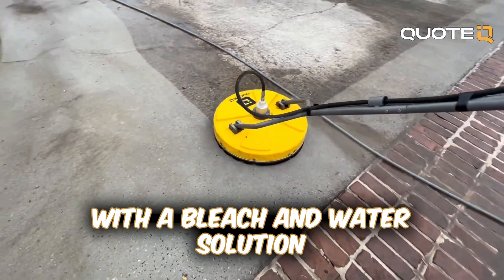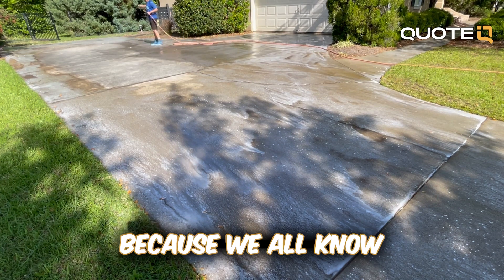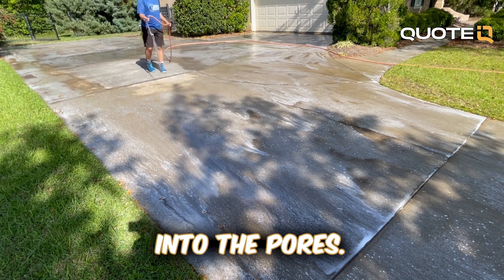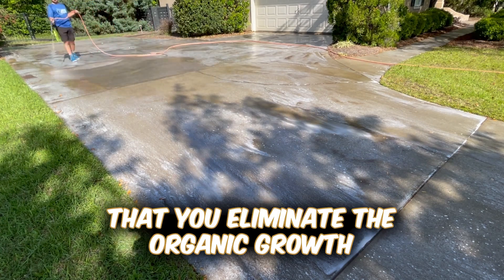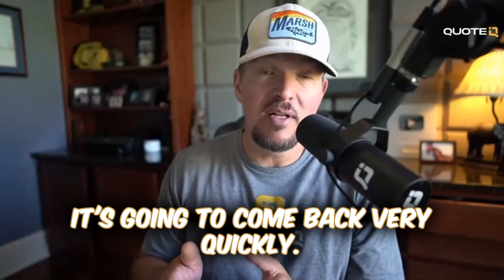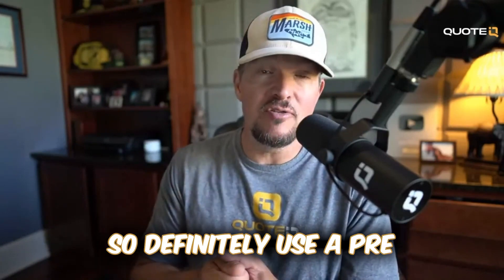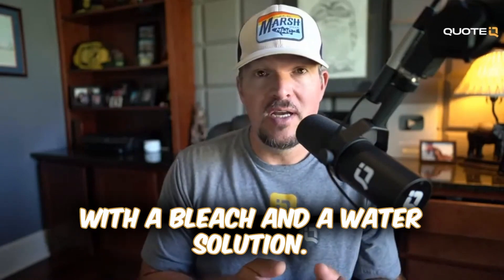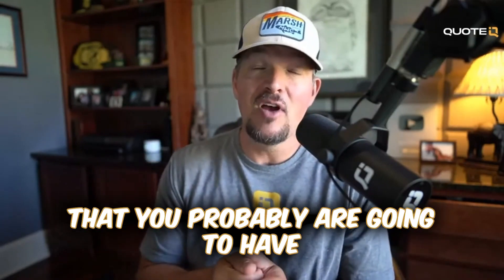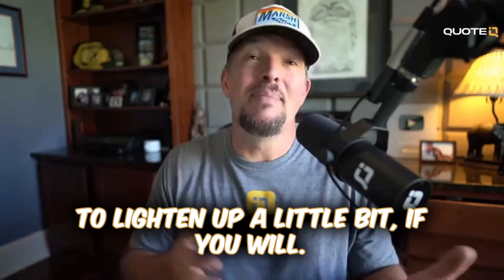You'll notice that we typically do a pre-treatment with a bleach and water solution, which helps to kill all of the organic growth on and in the concrete. It's a very porous substrate, and these organic materials are living — they root down into the pores. So it's very important to eliminate the organic growth rather than just remove the surface nastiness. If you don't kill it, it's going to come back quickly and the job will look bad. Use a pre- or post-treatment with a bleach and water solution to kill all the organics, and it's also going to cover up a multitude of sins you may have when first doing a pressure wash.